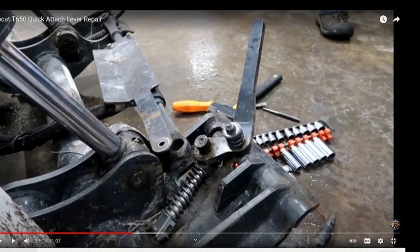This is how this works. Yeah. I definitely did notice, I thought, okay, what if I'm doing a very big thing, like the big trencher, or some implement that's just really heavy? The Bobcat Quick Attach doesn't really handle much beyond a couple of thousand pounds. It's not designed for heavier duty use than that. Even a bucket, if you try to really work hard with it and lift it with all the force of the live track, the bucket came off using this.